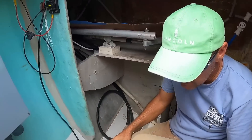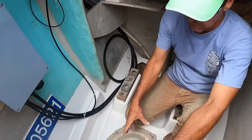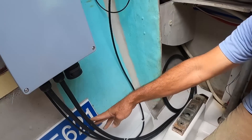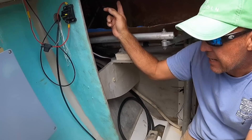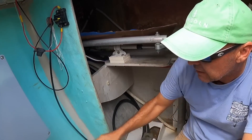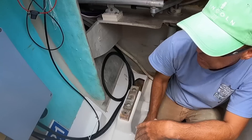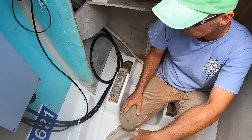So the setup for these electric motors is pretty simple. There's a pylon that comes out of the motor and hooks into a box with a positive and a negative. Out of the box comes a positive and a negative, and we run this to a bus bar back here. From that bus bar they connect to the batteries. This third cable is just a data cable that runs to an emergency stop switch, a key switch, and also the throttles.